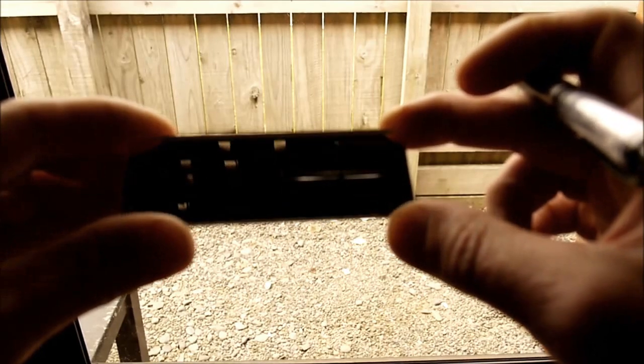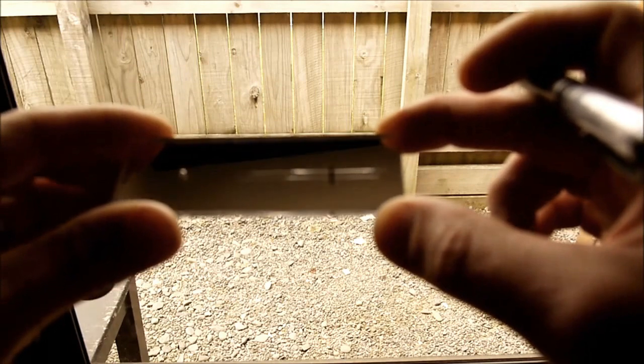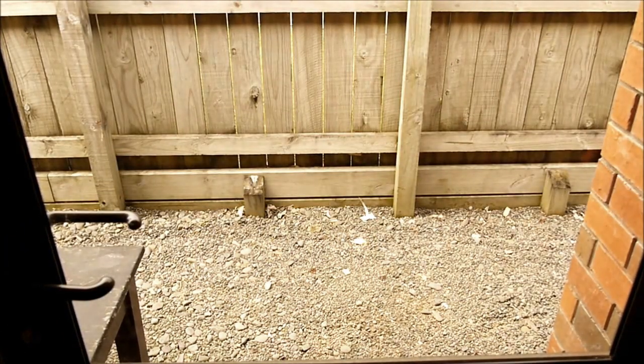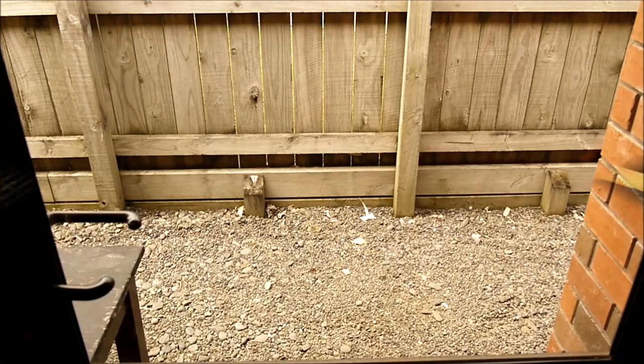If we twist the mirror, you can see where it's at its sharpest point — and that would be here. So there is our sharpest point where the laser is most concentrated. I'm hoping this is coming out right — I'm looking at the back of the camera on the little screen — it does look like it's in the right place. So what we'll do now is go back to the laser and I'll show you how we set the laser up to find where the top of your most concentrated laser cut is going to be on the top of your surface.